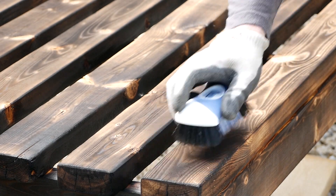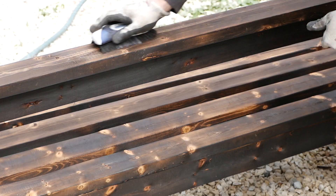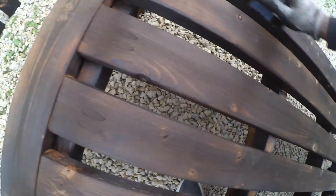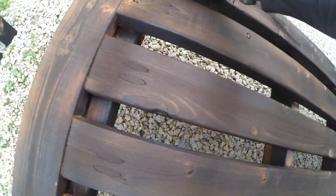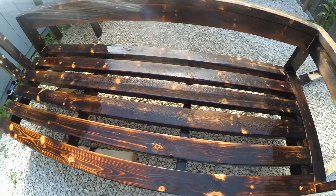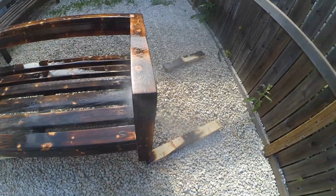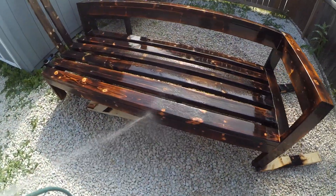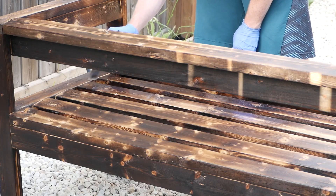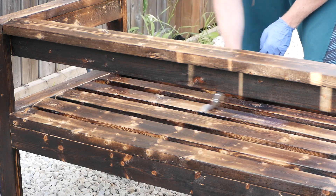Next I scrubbed all the char away using a nylon cleaning brush. I chose to use this brush because I first tried a wire brush on a test piece but it gouged the wood pretty bad. The nylon brush worked perfectly and left the wood with a nice even finish that didn't even need to be sanded down. Then I sprayed the whole thing down with water to rinse off all the char dust. I was also impressed to see how quickly after the wood was torched, water was already beading on top of it naturally without any kind of sealant. Finally, after drying out in the sun for a day, I applied two coats of water-based outdoor satin finish polyurethane to seal the wood completely, and it was done.